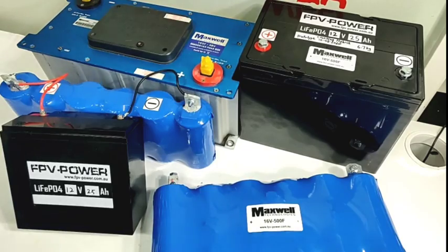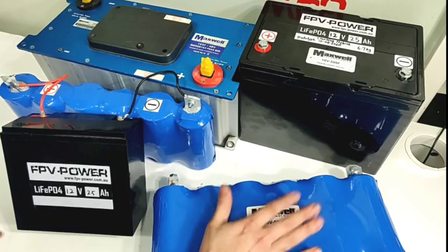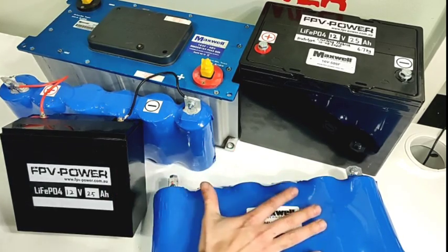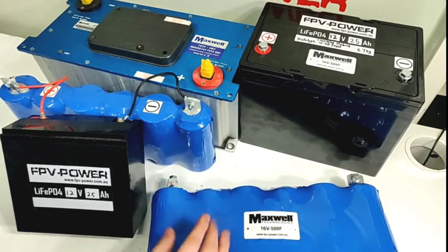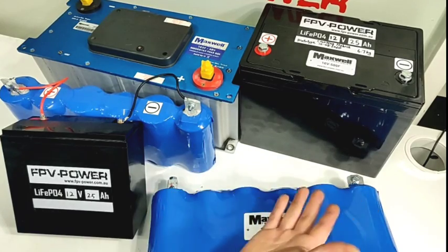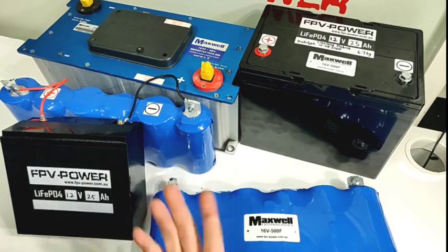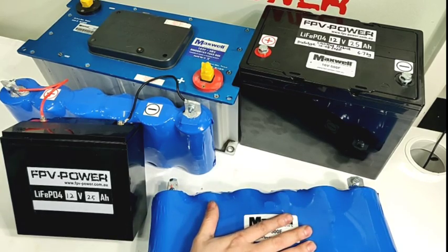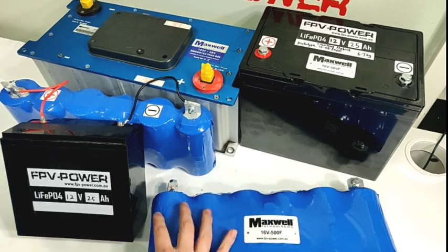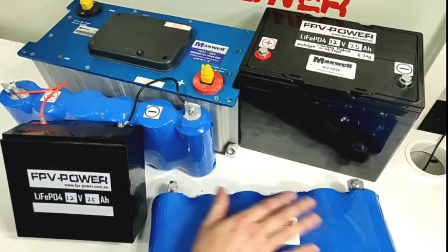The voltage has gone down to about, let's say, maybe 4 volts or whatever until the lights stop draining it. So in other words, at 4 volts, it ain't going to start a car. So as far as practicality, it is not really practical. Even though if I charge this supercapacitor up to, let's say, 13.8, 14 volts, 14.2, 14.5, or up to 16 volts, and if I leave it, the next morning it would still be at about 13.8. And then after a week or 2 weeks, and maybe 3 or 4 weeks, it would be about 13 or 12.8 volts. So the voltage would slowly, gradually go down. But on its own, they hold the voltage.